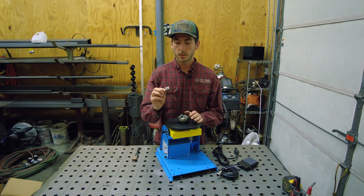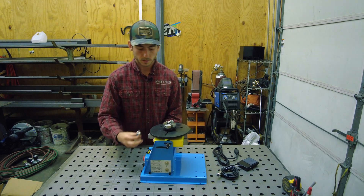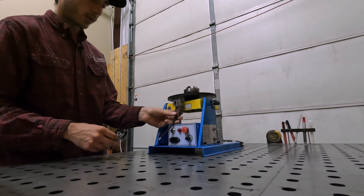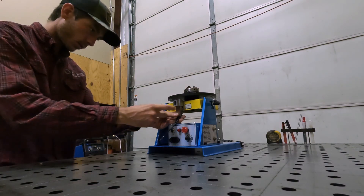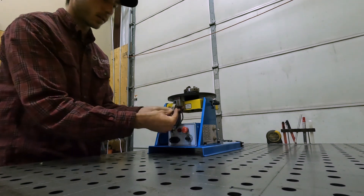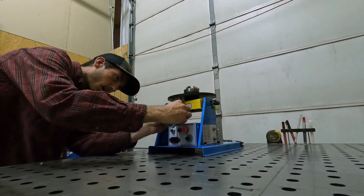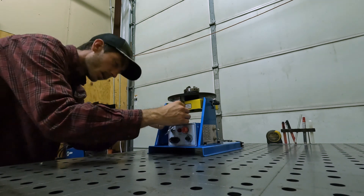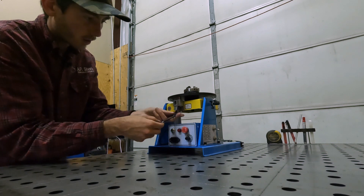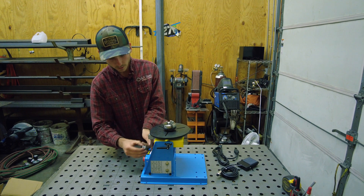This clip that I found in the box is actually meant to hold the grounding bar into the positioner. You put the grounding bar up into the slot, and then you take this piece with a curled end and put that up in, and that holds it with tension up against the wheel. We'll see how well that actually works. I don't really like that design, but we'll see. So I'll take it out for now.